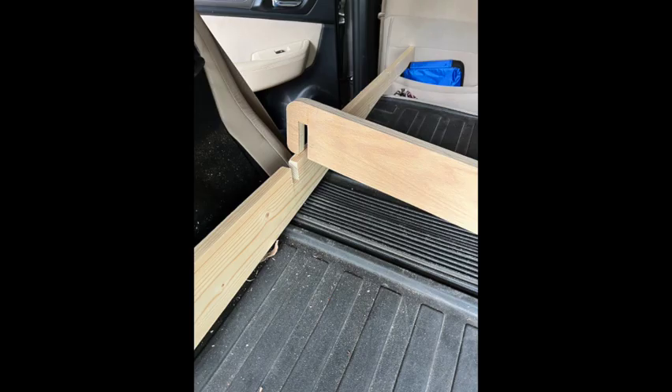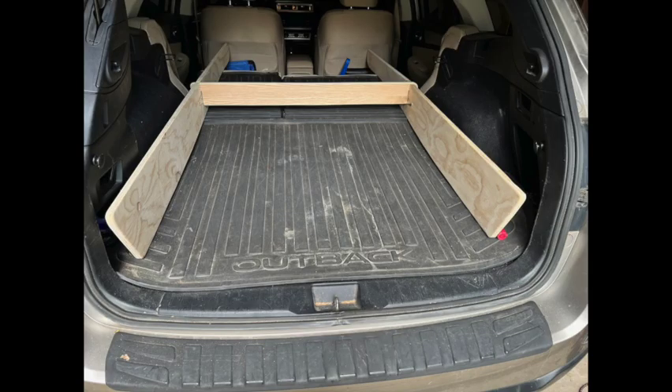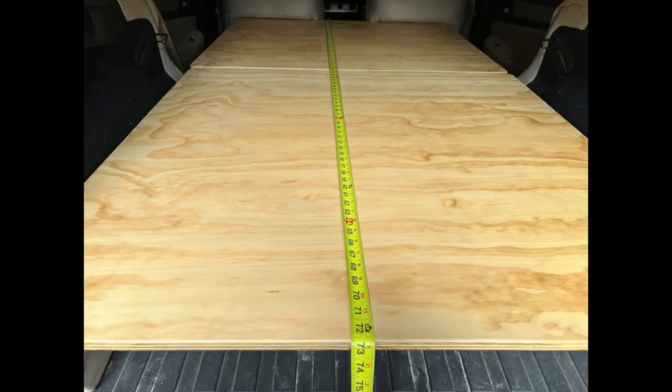Here is the completed setup — again 72 inches from front to rear. That could be longer if your car is longer or you are willing to move your front seats up a bit, but I don't want to do that. I made the cross piece out of plywood; it is much stronger on those joints than pine would be. Here you can see the grain of the wood running from side to side. That is important — make sure you don't run it the other way, as it is much stiffer along the grain.